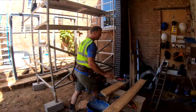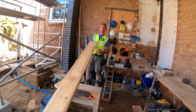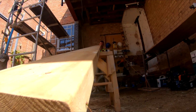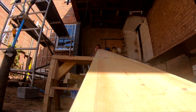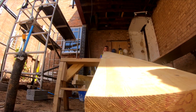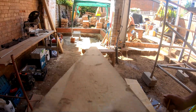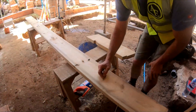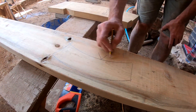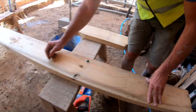The first thing to do when you're looking at a piece of timber — we're using 8x2 — is to look down the timber. You need to make sure the camber is correct. The camber on this at the moment is going like this, so we need to make sure the top of the camber is always at the top of the rafter. If I draw that on now, that camber there always goes to the bottom, and that's then the top of the rafter.